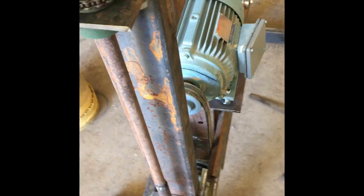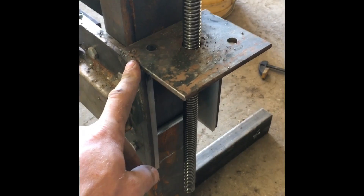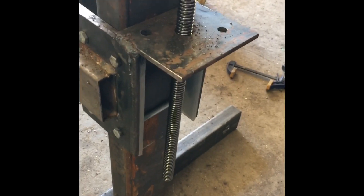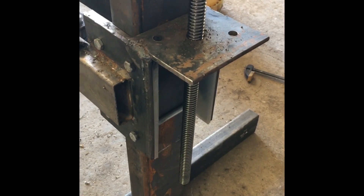But yeah, this is just the simple lowering and raising mechanism — just a simple screw. It's a little tight, I need to adjust. I have some plastic here and I was just going to do bolts, but then the two sides weren't staying parallel with each other, so I ended up needing to weld it together. I needed to tie it together so both sides came up evenly, otherwise it's going to have binding issues. I can still play with the amount of slop in there a little bit, but it's a little tight. I still need to figure out what's hitting.